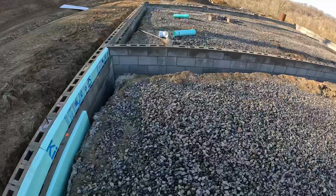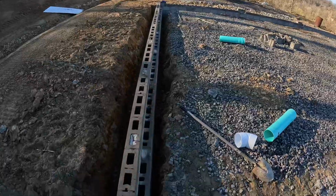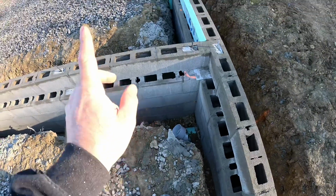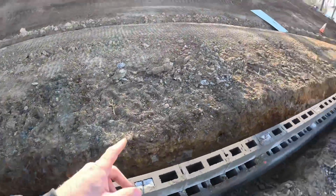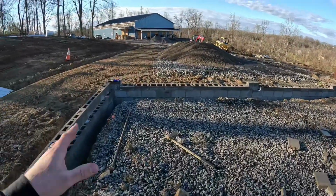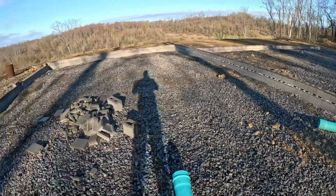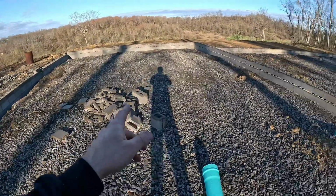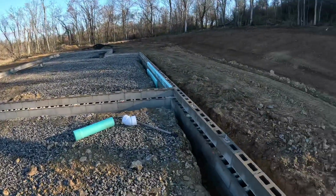In the previous video, I talked about how I had to dig and trench this out here for the waterline sleeve to come through, and then I got some 6-inch fittings. I'm gonna pipe this 6-inch sleeve up here in the corner for a future in-floor heat tubing, you know, for the outdoor wood boiler, like we talked about, maybe put it over there sometime. So got 2 tri-axle loads of stone here that we're going to use for the French drain, and then we'll top it off with 2B limestone, because that's what concrete guys like to have for finishing. So we'll get it all on grade. They'll come and build the building, and then after that, I'll come in and we'll do the plumbing through the house. So that's what we got on today's menu of things to do. Might have some help coming here from a good friend, and I'm going to get busy here.